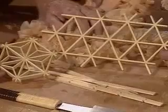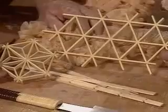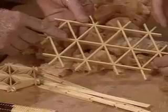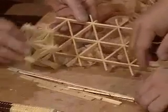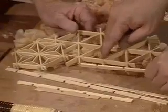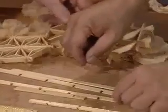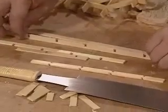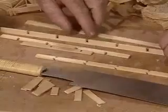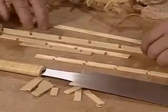So at each intersection of the hexagon and in the center, you've got a triple lap joint. Ah, so you have to cut away two-thirds of each piece. Two-thirds of each piece get cut away. And now when I do them in real life, they're much finer. They're only two-thirds the thickness of these. But so you have a bottom piece that's grooved over and over again in a small little fixture with a saw, with one of my hand saws. And then the next piece goes on that?